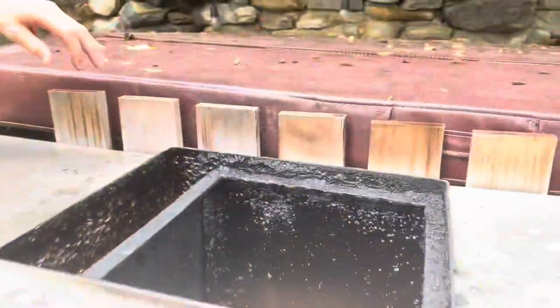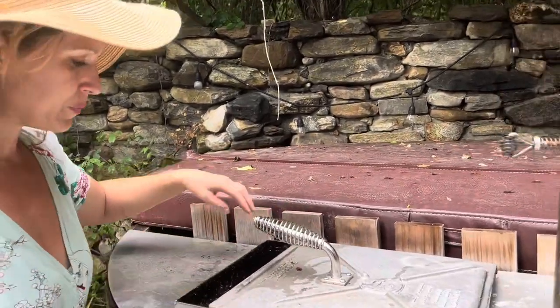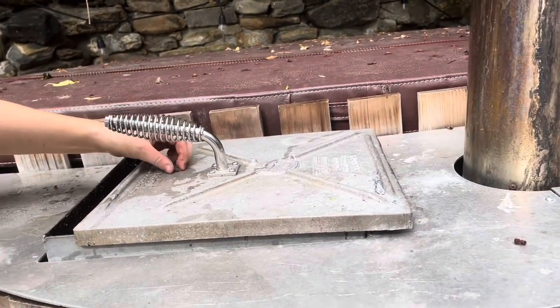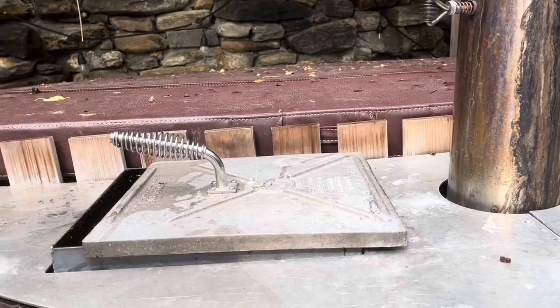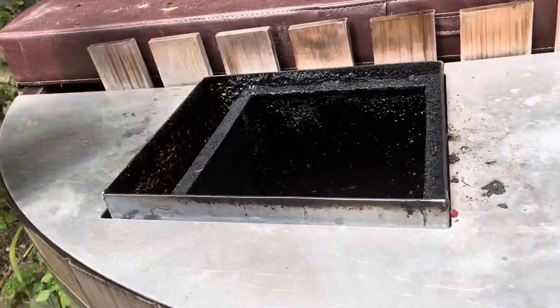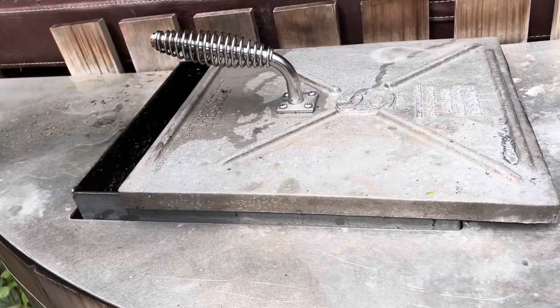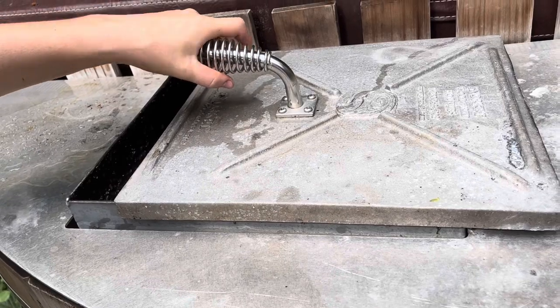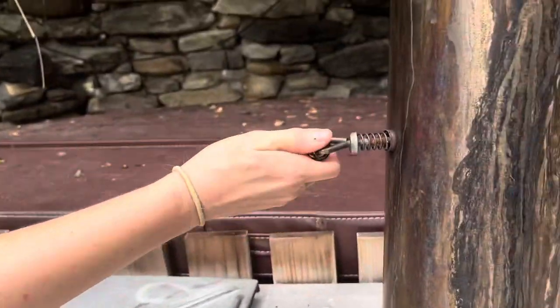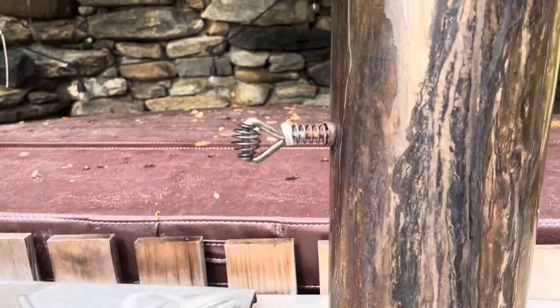I can give you fire starters — these little sticks. You make a little teepee; there are a couple of strategies. To start your fire, there's a piece of metal right here and you put this flush with that piece of metal to maximize airflow. The air goes through here, gets sucked up, burns around, and goes up the pipe. If you leave it all the way open it's actually not doing great circulation, so this flush position is maximum. Don't leave it the other way — that'll kill your fire; we actually had a guest do that and they lost the fire.